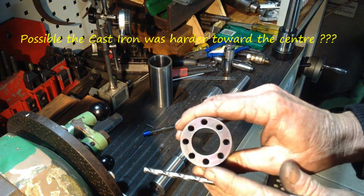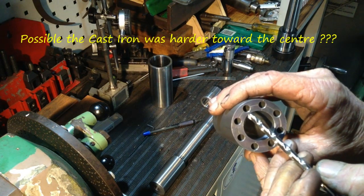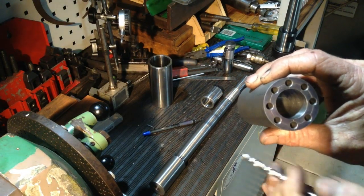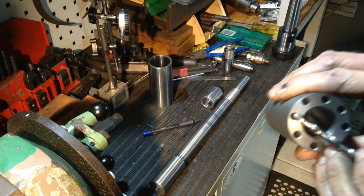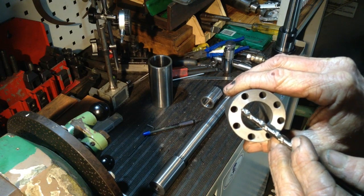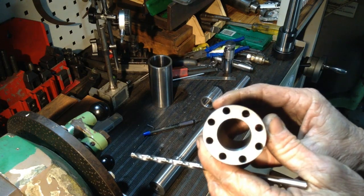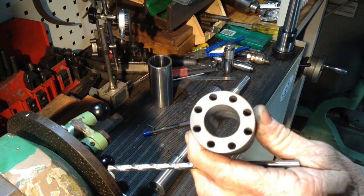because on our lap design we want to cut some slots through to the inside to enable the lap to expand. Now, because we're so close to the outside, if I cut our slots to the inside now, we've taken all the strength out of the lap. The thing is likely to just snap in half. So we have to have a bit of a design change.